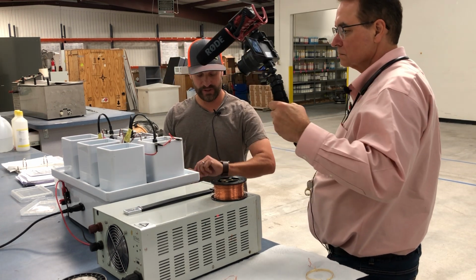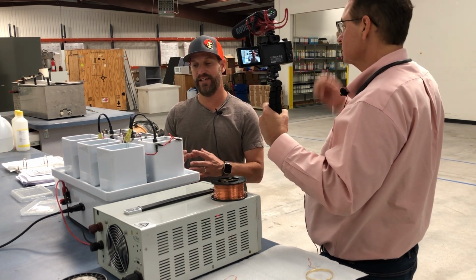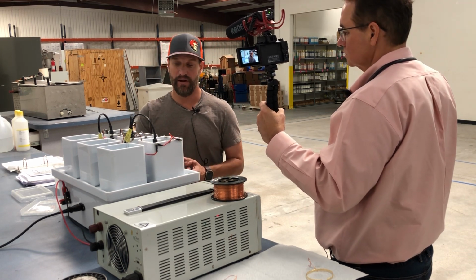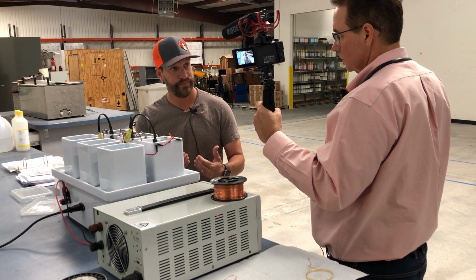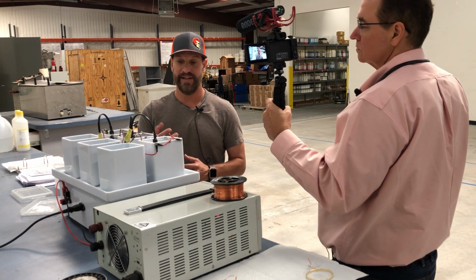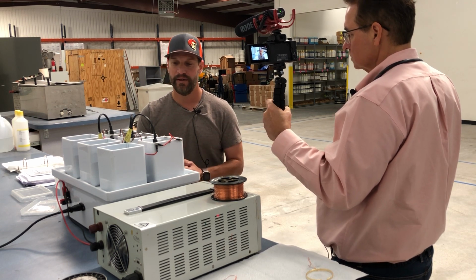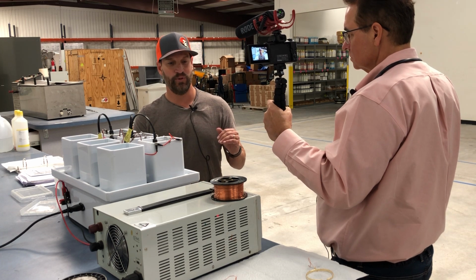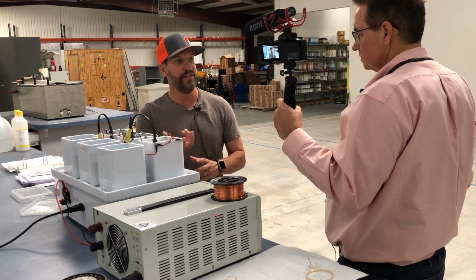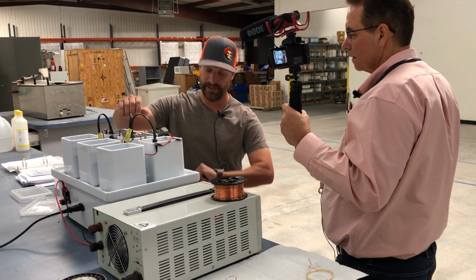So something we can talk about while we're doing this last piece is what difference agitation makes. I mentioned earlier that you have high speed, you have moderate. Agitation can change the color, because if you have no agitation, for example, and you have a bath that contains silver, so you're doing a gold bath and you need silver to get it to a green color, with no agitation, the silver will kind of settle in the bath and not plate. So your color will be completely different. So there's certain metals that need to be moving in the bath all the time in order to work properly. So it is important to pay attention to the agitation.